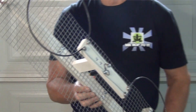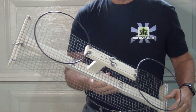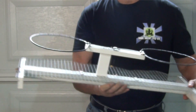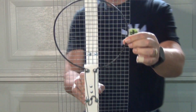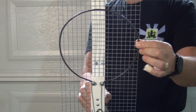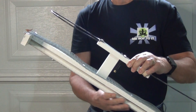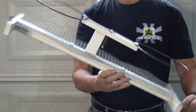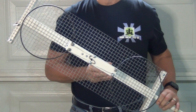The final antenna in this test is the double hoop antenna with reflector. Originally made with 16-gauge galvanized steel hoops, I've since modified it with solid 10-gauge elements. Using PVC board and a half-inch hardware cloth reflector makes this antenna suitable for either attic or outdoor mounting. This is the largest of the antennas in the test, and it has more concentrated reception focus than most of the other antennas. This antenna takes a moderate skill level to build.